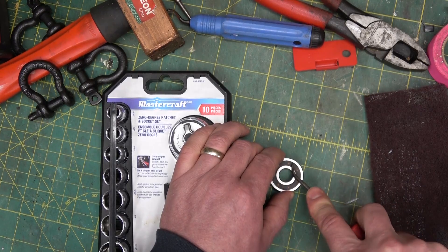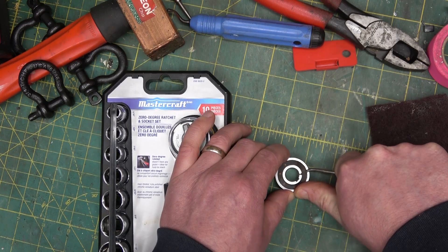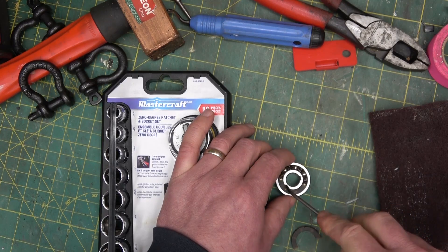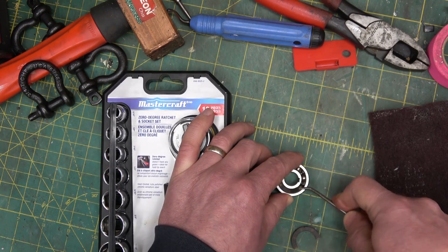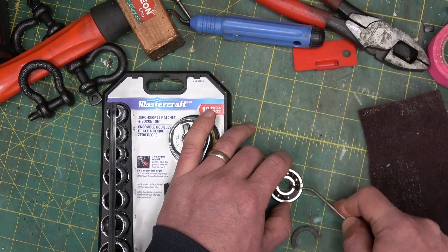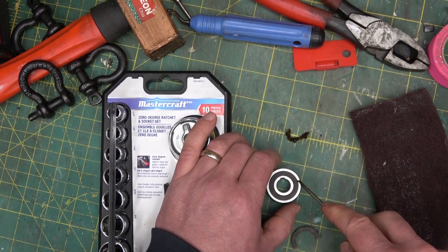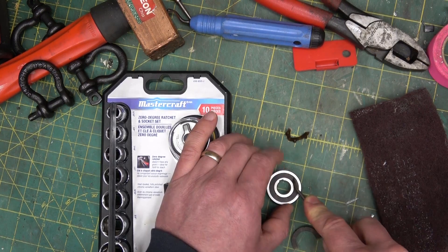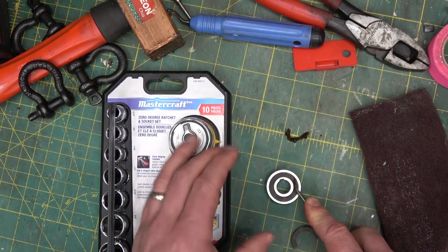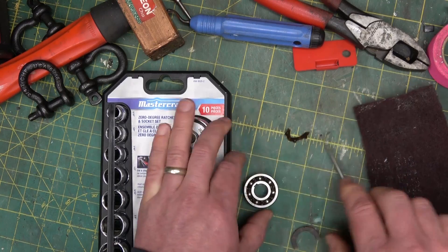That's on account of these small balls — there's a joke in there somewhere, but I would know on account of mine being in my wife's purse. Now this is the ball side and we see it's got a plastic cage so the rolling elements are caged in a plastic assembly. Pretty bog standard there on that side. Now let's look over at the other side. As I said there's different kinds of one-way bearings: there's backed ball, there's ball, and there's sprag.